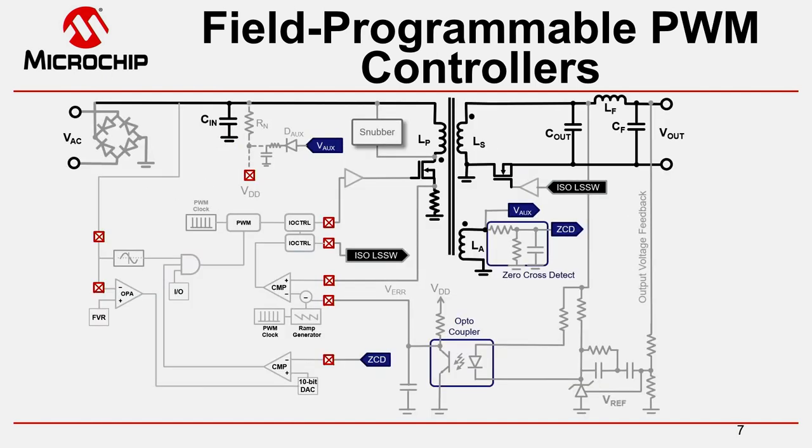It is not only about smaller non-isolated topologies. In larger scale isolated offline applications, these devices give you a lot of flexibility to design more sophisticated power supplies. For example, a quasi-resonant converter flyback operating in so-called transition mode — meaning it incorporates the function of a PFC while converting power from AC to a DC output. In this application, we need a specific input interface to detect zero crossings of the AC voltage and use that rectified signal as a reference for the inner current reference. By having the flexibility to interconnect multiple different modules, we can establish a control loop perfectly tailored for this highly specific application.